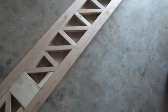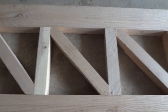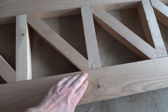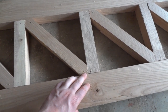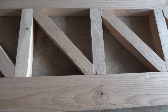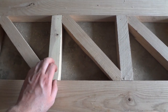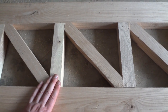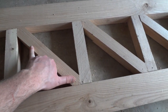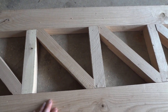As I said, this is a Pratt truss — this will be the top and this will be the bottom — which means the vertical members are in compression and the diagonal members are in tension. If I were to flip it around the other way, it would be a Howe truss, with these in tension and these in compression. But I decided to make the shortest members in compression so I don't have to worry about deflection — these are just a little over 11 inches long, inch and a half by inch and a half, so deflection wouldn't have been a problem.